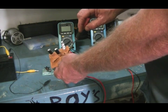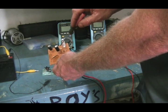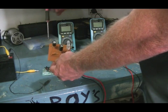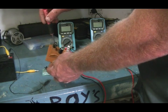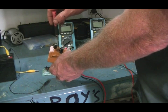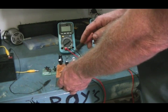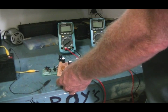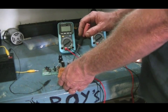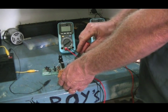Now on the negative rail I've got a diode blocking a positive charge going to the negative side of this cap, so that will only take a negative charge that way. And then from the positive input I'm going to the positive side of the cap. I'm using a small — it's only a three ohm resistor — just to take out a hard hit when I first fire the system up, and the cap drawing all the current which may blow out the 555 timer chip.